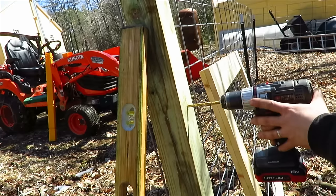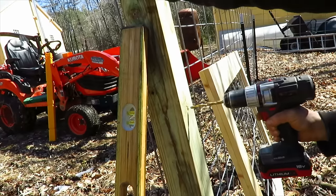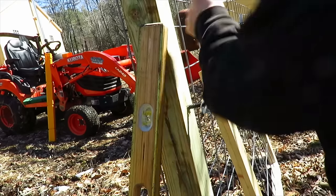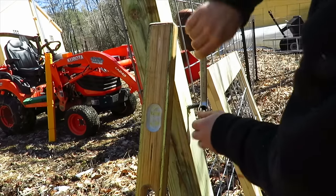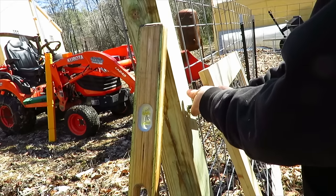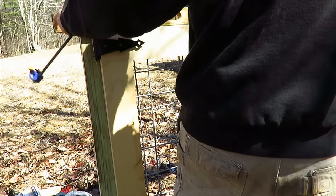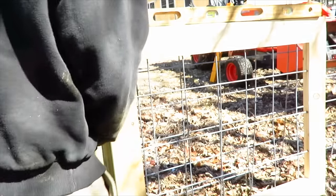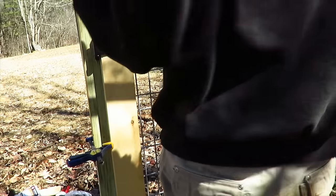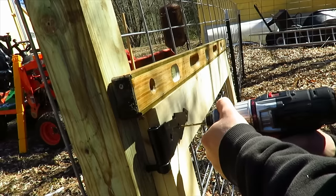You want to make sure your drill is level when pre-drilling. I found the best way to get leverage on these hinges is to use a wrench — put the box side on it and just keep tightening it right up. The gate is level and holding; I'm using a clamp to hold it in place, then pre-drilling so I don't crack the pine.